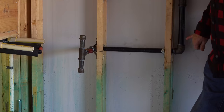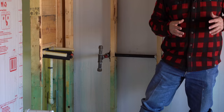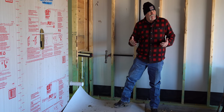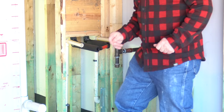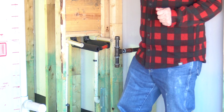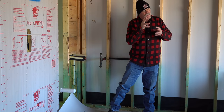You've got dual gas outlets, three-quarter inch. The one thing I don't like — they've got a one-inch drop down on the side, then they go to a one-by-three-quarter reducer. I would run one inch all the way out just in case you ever put in a higher BTU tankless water heater and need more gas. Depending on the load calculation for the house, you may need to increase the size of the meter. They've stubbed one inch in but then reduce to three-quarter going to the water heater.